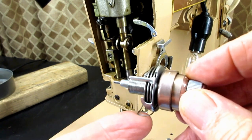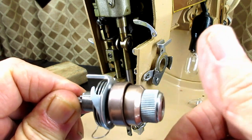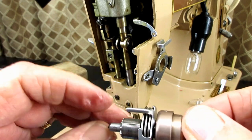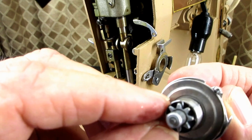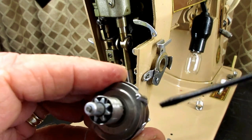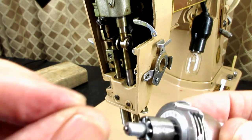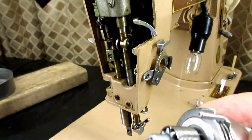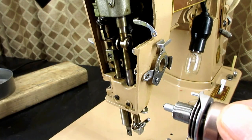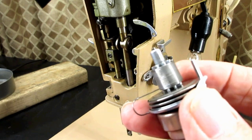You can loosen this enough to pull it out, and once that is pulled out you can just wiggle that tension unit and pull the whole thing right out. There's my tension releasing pin sticking out, here's my check spring, you can see all the discs. I can turn it left to release tension, right to increase it. There's my little spring tail — it's between these two gear teeth right here. There is a procedure to pull that out, twist the spring, and put it back in a different slot to the left or right for more or less tension. That's in the setting the stroke video.